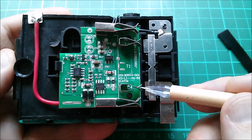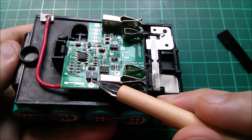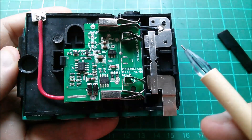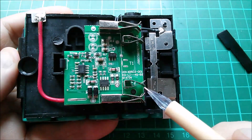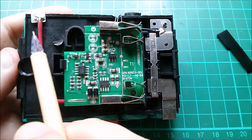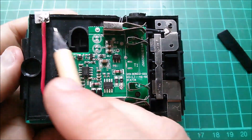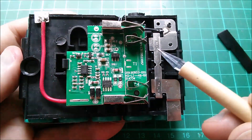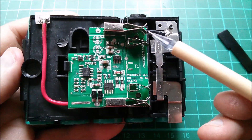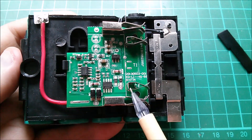There's a C-plus terminal which appears to be the charger positive, going into a MOSFET. The charger input comes in, goes through the MOSFET if it's on, and through two diodes into the battery pack - so this is a charging cutoff. A chip controls this and presumably monitors the total pack voltage across all five cells. There's no under-voltage cutoff by the look of it, so the pack relies on the power tool to handle under-voltage.